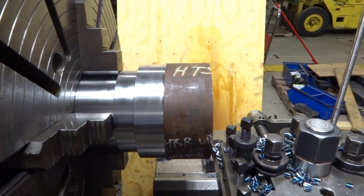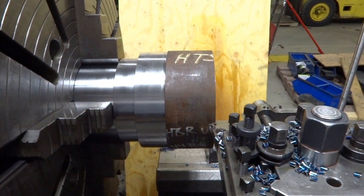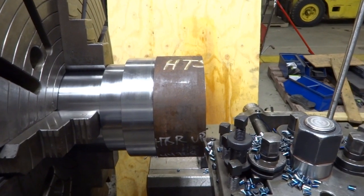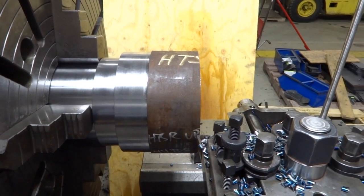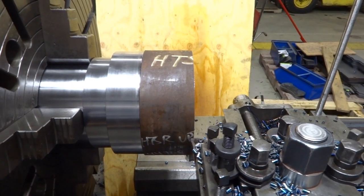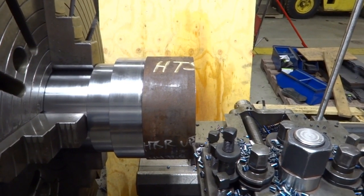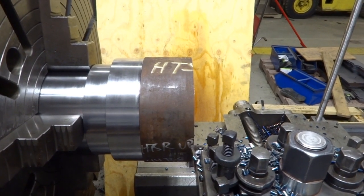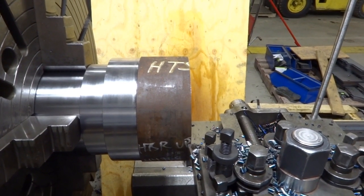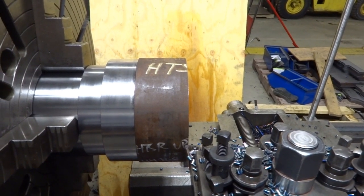This is a piece of 4140 heat treated stress relief, just over 8 inches in diameter. I'm an inch too long — I didn't realize that when I put it in the lathe — and I need to face off an inch of material. I'm taking a couple of passes, a quarter inch wide pass. I'm running at 355 rpm, a 21 thou per rev feed rate. The tool is advancing across the work at 21 thou per rev, giving a material removal rate at the start of the cut of about 46 cubic inches a minute.